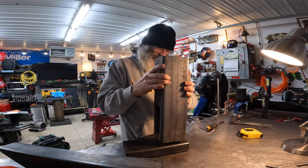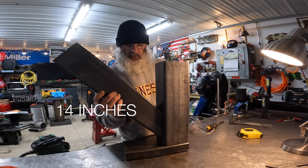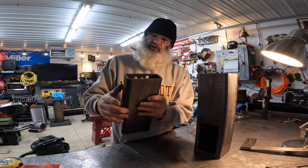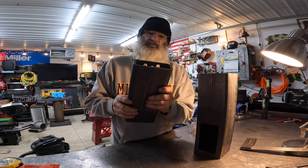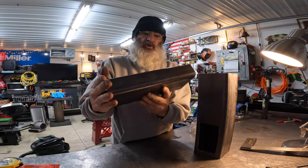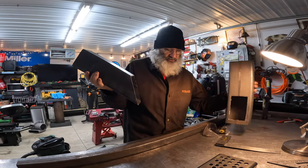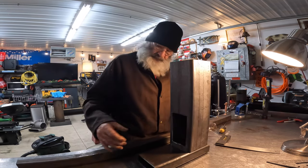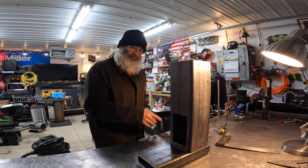Here's the bottom, here's the stack, here's the feed tube. Now I have to put a piece of square tubing on the back of this — not only to give it balance but to block the airflow from coming in this way, so it can only come in this way. I put this on the wet saw and cut it to 14 inches because it looks right. Now I'm going to cut a foot off of this square tubing and then I'll be back — I'm almost ready to weld.